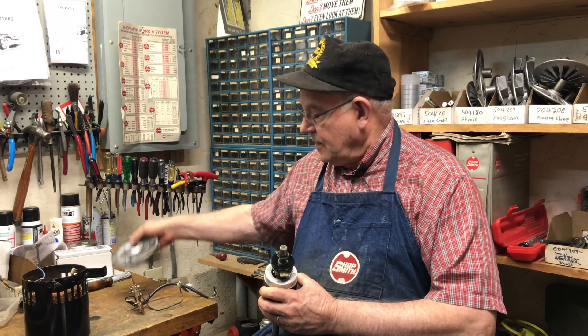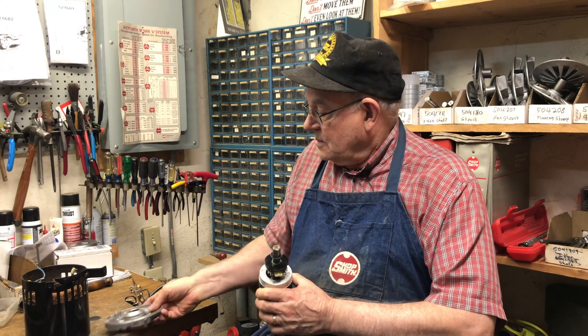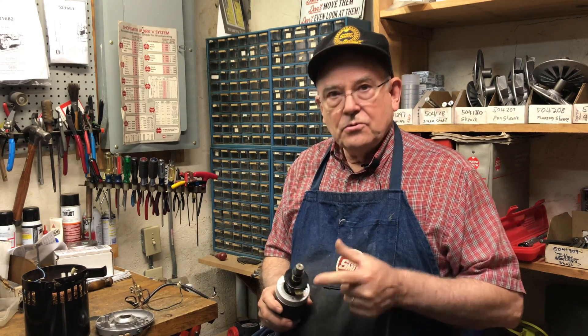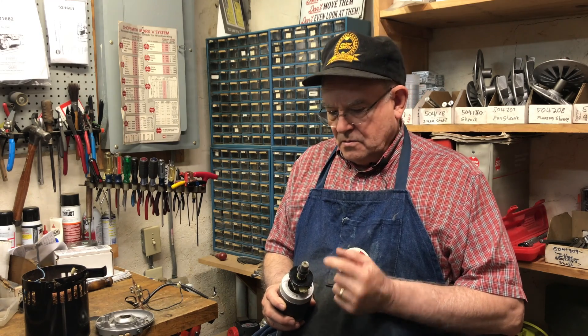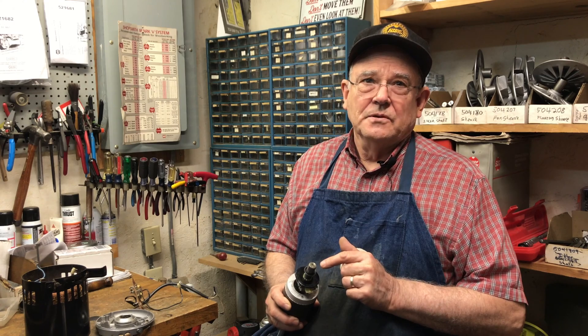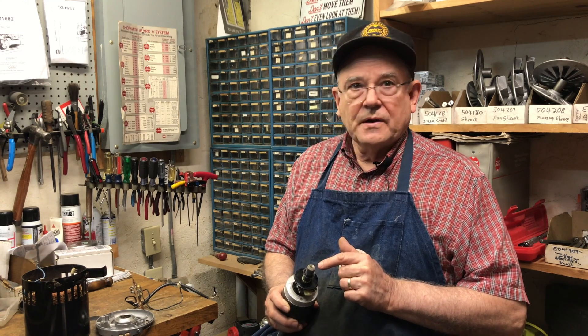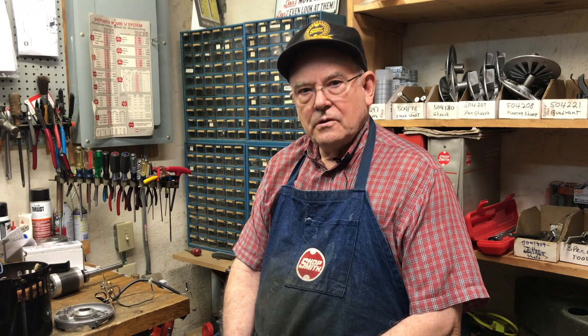This particular motor has a sleeve in the background that goes into a bushing on the end cap, as you can see. You may find that your motor has two bearings, because most of them do. I don't prefer this design, but it was used for a long time in the Shopsmith motors. Most of them came from Mexico.